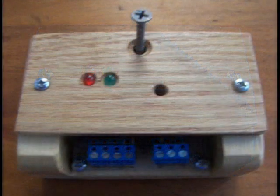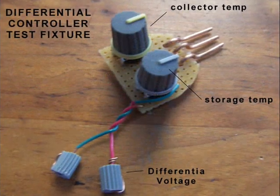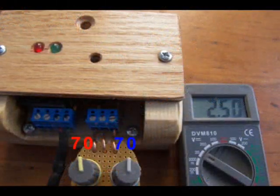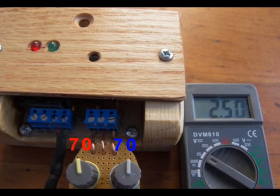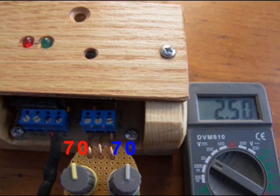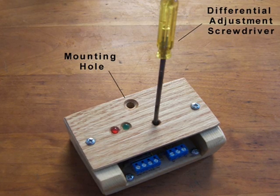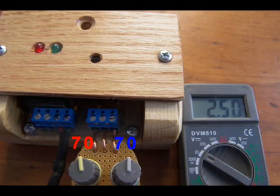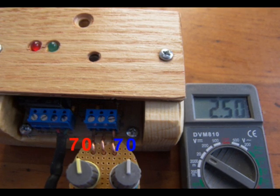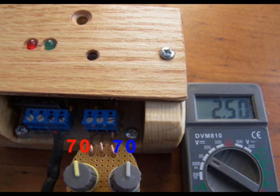Congratulations on the completion of the enclosed differential controller. Now we're ready for testing. Instead of using thermistor probes that change resistance with temperature, we'll use a set of variable resistors to simulate temperature changes between 5 degrees Fahrenheit and 250 degrees Fahrenheit. The pot on the left simulates collector temperature, and the pot on the right simulates storage temperature. The central pin of this 3-pin connector is used to measure the differential voltage. We'll use this to estimate the differential temperature. For our first experiment, we'll set our differential pot midway between energy collection and energy conservation. The test fixture pots are also adjusted in the mid-range, so the collector and the storage temperatures are both about 70 degrees Fahrenheit. Notice that both LEDs are off, and the differential voltage is midway between the plus 5 volt reference and ground, or 2.5 volts.